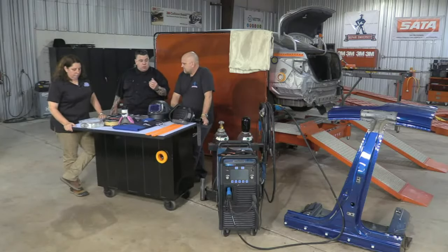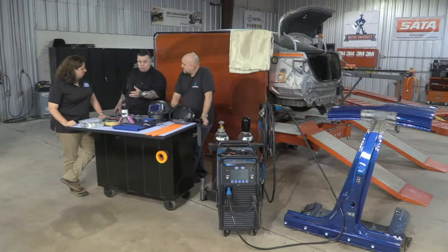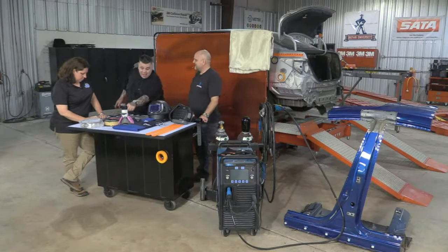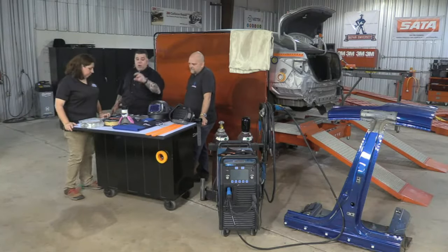You just welded perfectly. I made practice welds that were perfect. I get to the car and it bird's nests on me. What happened? I got a bad spool of wire, or I'm at the end of it. Or I run out of wire. That's another big thing. Guys never open it up and look and go, I don't think I have enough wire left to finish this weld, because I can see the black of the plastic through the wire. Let me change the wire. Or I run out of gas. You don't want to run out of gas or wire on a vehicle.